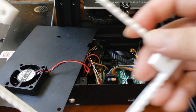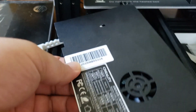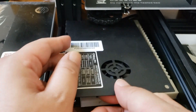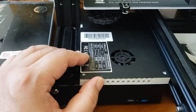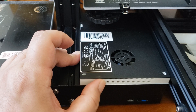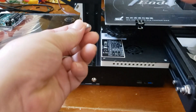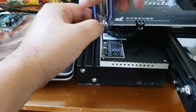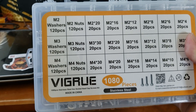Some of the configuration edits I made to the firmware I'll leave for the end of the video. You're going to have to print up something like this — just thread it in like so. I have to make something that's going to have clearance for the knob, so I'm going to have to design that. I have holes on the front and side so it gets a little bit of air. You are going to need longer M3 screws — I suggest an assorted pack, which will give you an assorted size of screws with the lengths you need. You're going to need the M3 20.